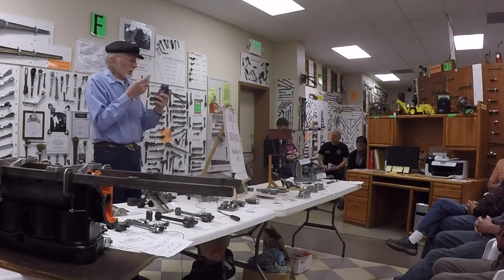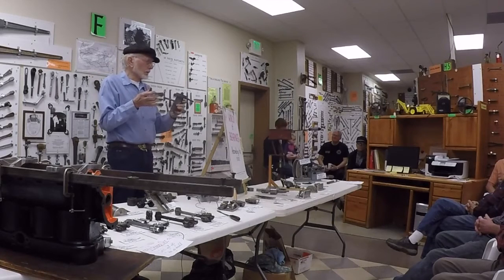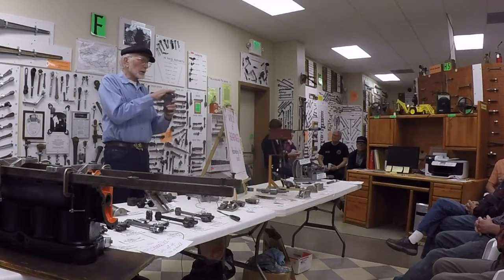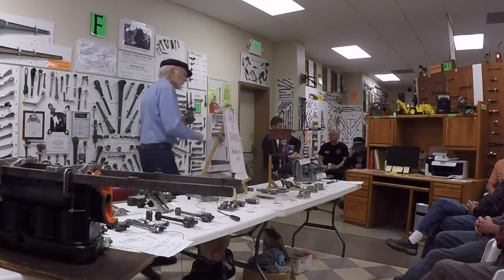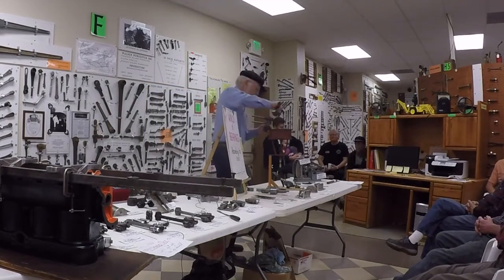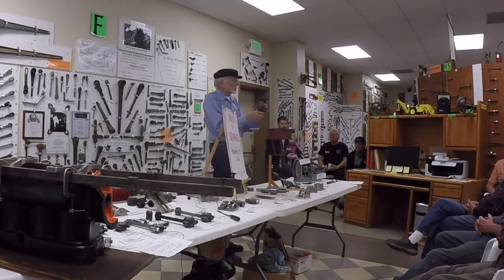it's got it in the vise. You heat up the cap up around 400, 500 or hotter. Get this pouring fixture up about 300. Take your ladle and you just pour it right down in there and you fill right up to there. Sometimes a little Babbitt will trickle out, no problem. Have a spritzer bottle there, give it a couple of shots and it'll freeze over.